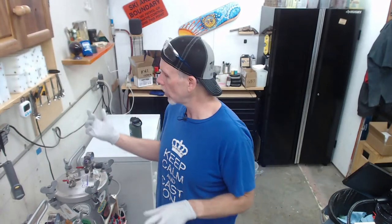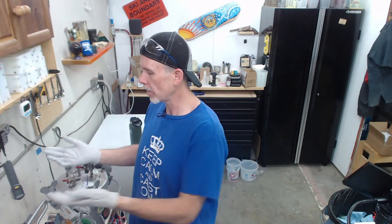That would probably work. One of the biggest problems, like people ask me, especially for Alumilite Clear, is there is just not enough time. You will not get it vacuum degassed in enough time before the resin literally is solid. It can take 20 to 30 minutes, and so even with a 30-minute working time resin, it's getting kind of close. The 2-hour resin, you can probably do that, but I don't see the point, really.